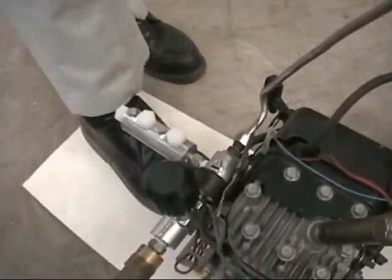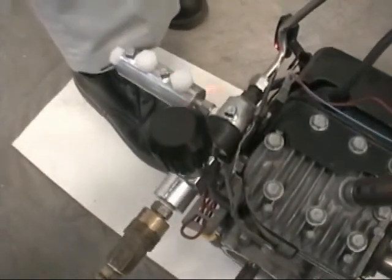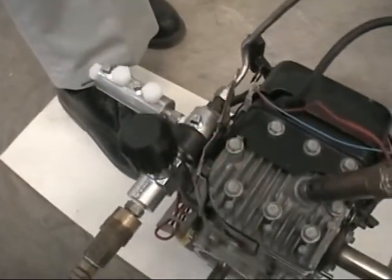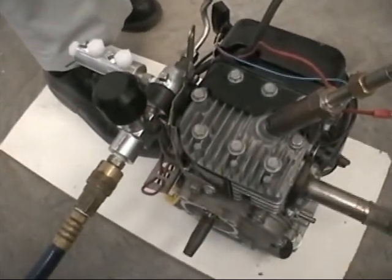And well, there happen to be for many different fuels. You could bring 3 different fuels here together with this pilot fuel on high boost. Oh, what you're saying is, here comes the hydrogen. This could supply gasoline or diesel or natural gas or propane. Sure. So we can mix it with the hydrogen to get better combustion. That's exactly right. So it can run on hydrogen or it can run on a combination of fuels. It can run on quite a large number of combinations that we call high boost combinations.